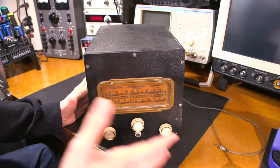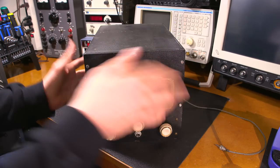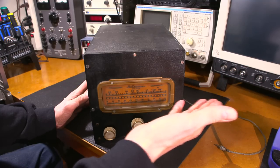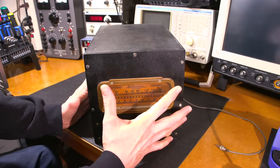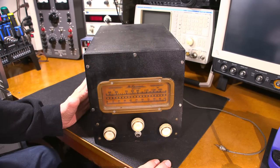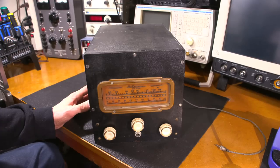And if, say, the people in the rooms want to listen to a radio station, they would have the audio lines from this in a main office running into the room, and they'd have a selector switch, and you can select between either receiver. That'll allow you to listen to two separate radio stations. Well, you're saying, why not put a radio receiver in everybody's room? Well, way back when, radio receivers were extremely expensive. So having two radio receivers and just a whole bunch of audio lines running into each room saves a lot of money. Each room would have maybe a small little amplifier or something like that with a speaker in it. And you could just click a switch back and forth and choose whatever frequency you want.